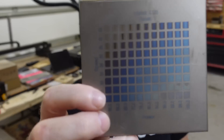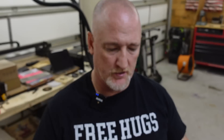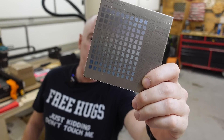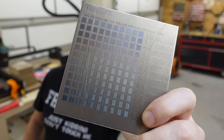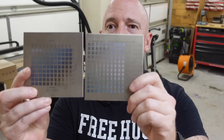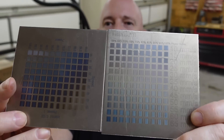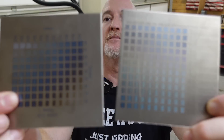But then we have titanium, and this is kind of a mixed bag. Here's titanium with the X-Tool D1 — see all those really good blues? Here's titanium with the P20 Plus — you don't get as vivid of blues. These are pretty close to the same settings for both of them; they're not exact, but the ranges are the same. So with that, I would say the D1 Pro does a better job with titanium.